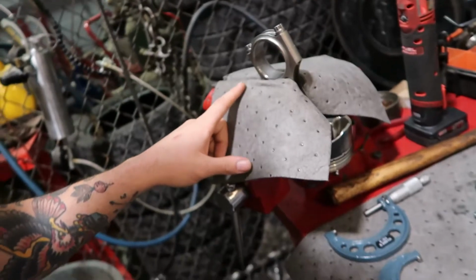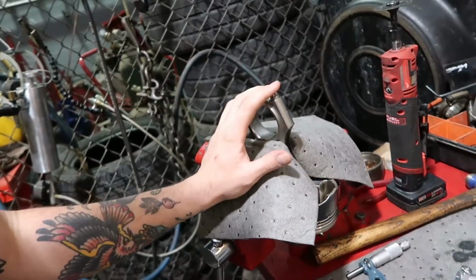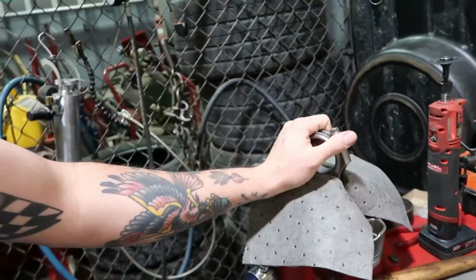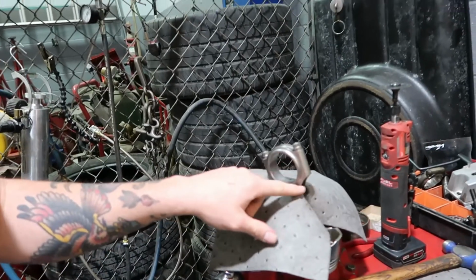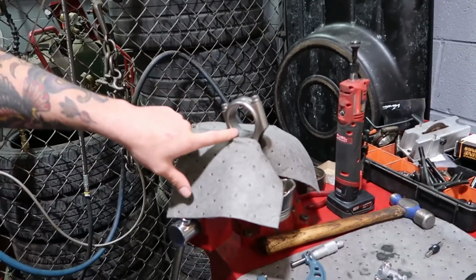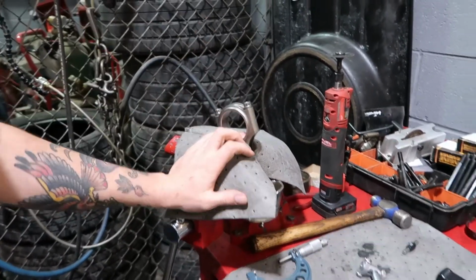And then what is important though is that you have this surface very clean, and then you got to torque them down. Make sure they match on the sides if they're married rod caps, which they all should be, but in our case they're directional. They're married to each other in that specific way. And then you torque it down, and then you can measure that, and then you make sure everything's clean, everything's nice. But it's not that bad after you start doing it.